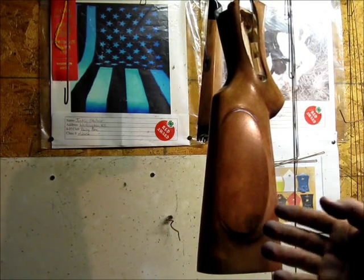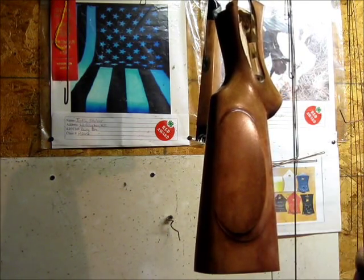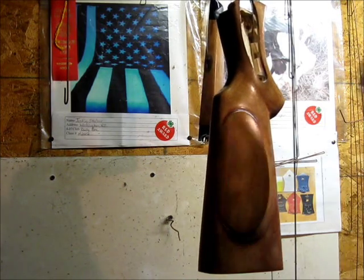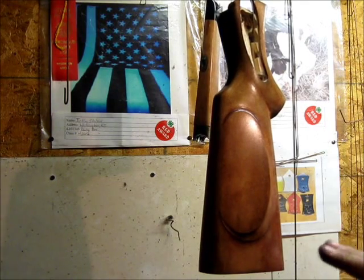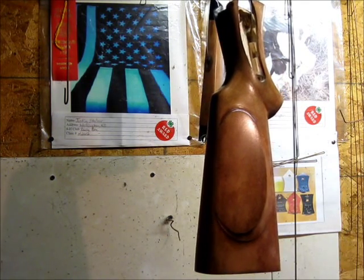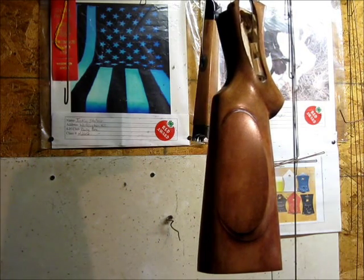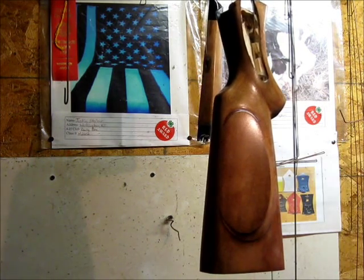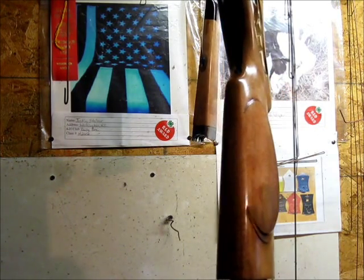And so I make this oil myself, and it's put on pretty heavy as a first coat, and then it's rubbed back with the Brillo pad, using that as a wet sanding base, and that fills in any open grain in it, fills in any structure in there that isn't smooth from the sanding and finish process. And then every coat after that is done strictly by hand,